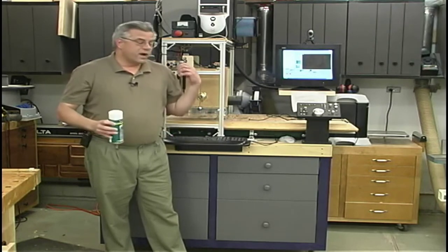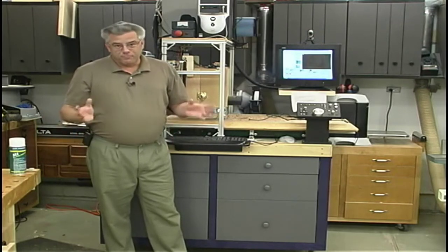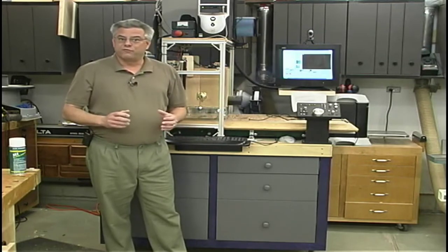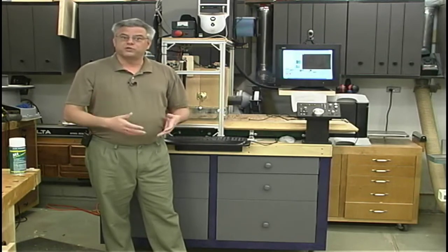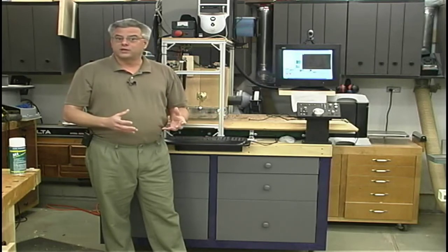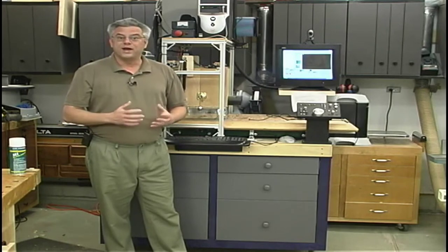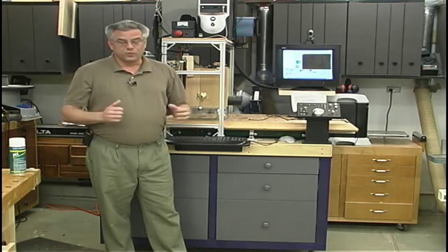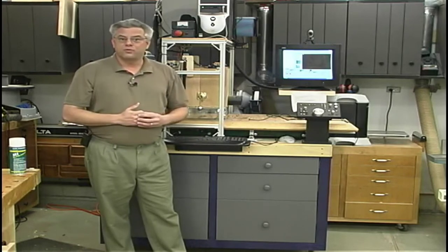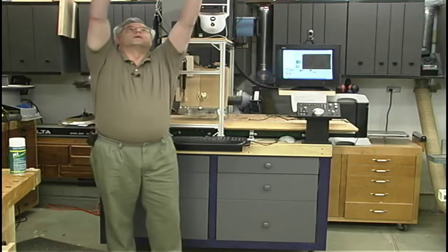So I've given it a try here on a couple of the ball screws, and it's performing quite well. Being a dry film lubricant, I thought perhaps even the table saw might benefit from it, for the trunnion adjustments for the elevation and tilt and so forth. You never want to use a wet lubricant on those either. So I sprayed them with the same lubricant. It's working quite well in that application as well. So we do have this fresh new update with regard to the ball screw problem that we were having. Now we'll return you back to the original program.